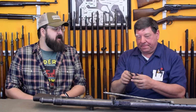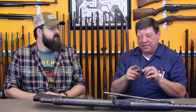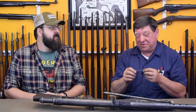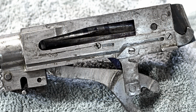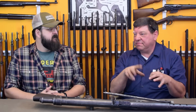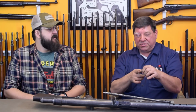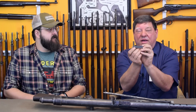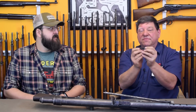So he did manage to fish the part out and send us a photo, and that's how we were able to develop this. There were a lot of clues inside this gun that several machinists had tried to go after, because there's enough Prussian blue in this thing to start your own country, I'm going to tell you. This piece runs in a zigzag groove on the side of the entire rear receiver, and it was an obvious add-on. Somebody milled out a space, dropped a plate in, and as that entire rear end of the bolt is going by, this is being lifted and dropped. It's only moving up and down about 325 thousandths of an inch.